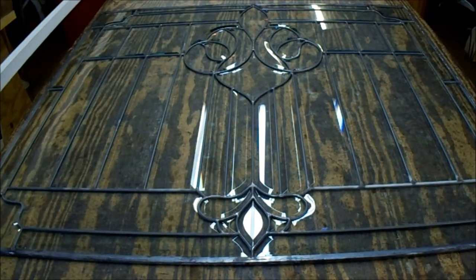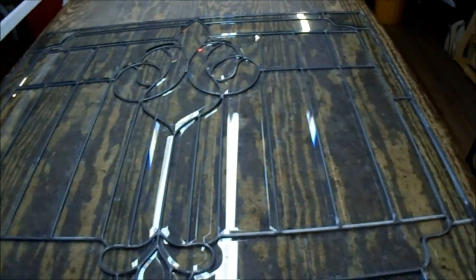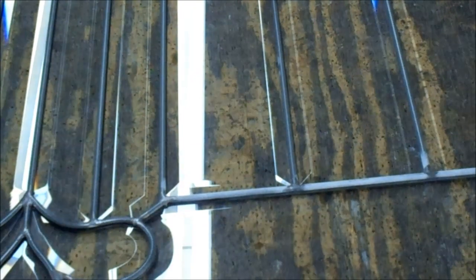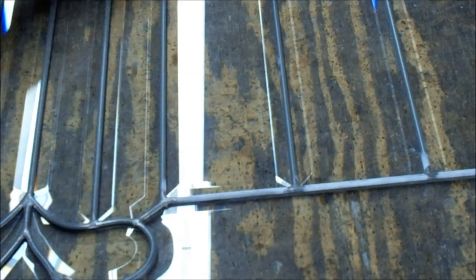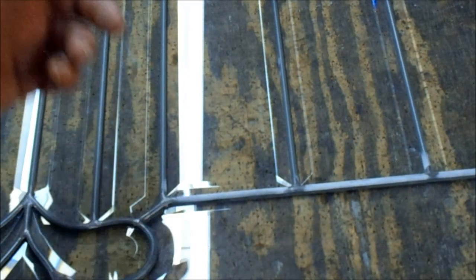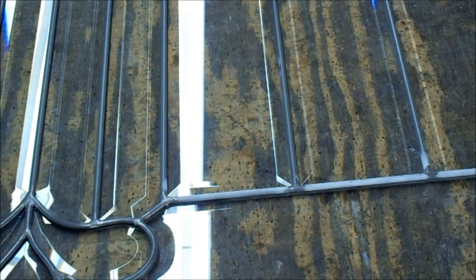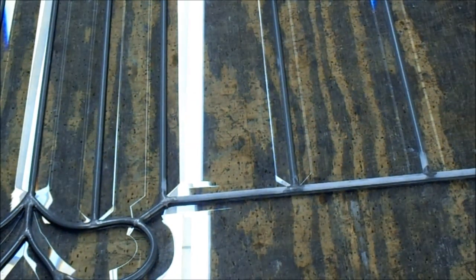Even though this is made out of zinc, the people left off a very important part of the procedure. When you don't glaze and you don't clean, this is a little bit of corrosion. If it had been glazed, cemented, puttied, and then cleaned off with whiting and a dry absorbent, this corrosion probably more than likely wouldn't have happened. There's some up here, some over here — whatever was not cleaned off when they did it. They got the glass perfectly clean, but the lead isn't. This is one of the reasons why you don't leave off cementing: lead-camed or zinc-camed windows need to be cemented and glazed. Windows get part of their strength from being cemented, especially something this big.